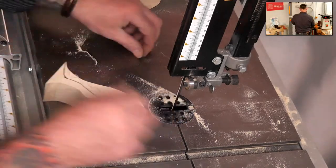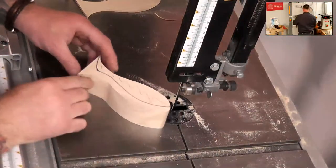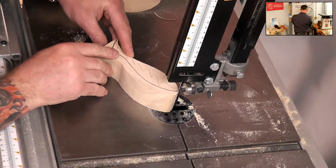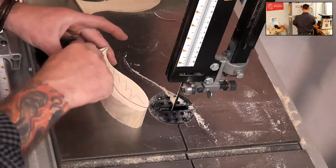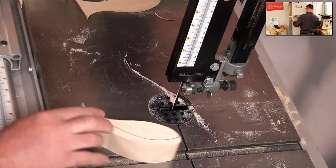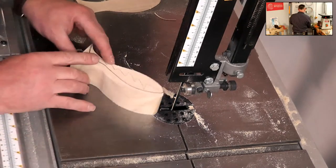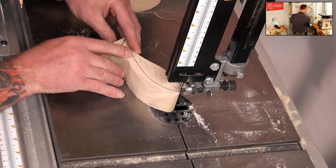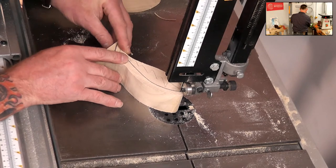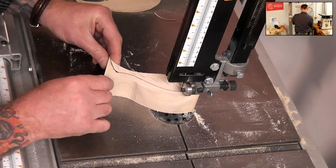All right, now we are getting every cut. Make sure the material's smaller. And you're just going to make sure you know where your fingers are and you're not getting too close to that blade. All right, and we're just going to follow this line and come out at the tip of the tail here. Extraction on. All right. Start gently, get those teeth bedded in. You see those bearings whizzing round now, keeping me in exactly the right position with my blade.